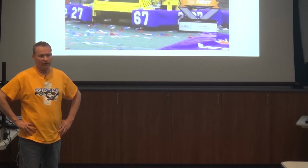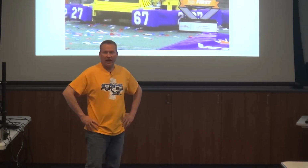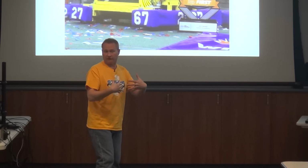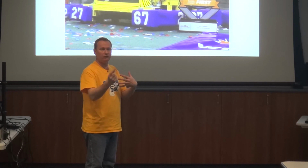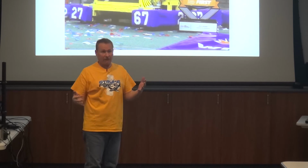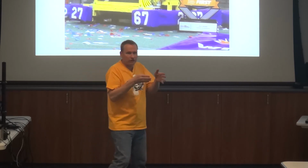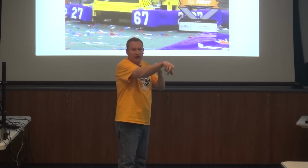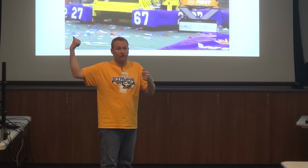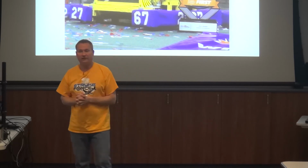Yep. So the way to think of it, there's actually quite a bit of DIO going into the Talon, and you can tell the Talon, I want to use that as my feedback. But that doesn't mean you can't be feeding other things into it and have the Talon tell the RoboRio what's going on. Now, you can't feed in 2 quadrature encoders because there's only one set of hardware. But if I'm actually using an analog pot for my encoder, I could feed a quadrature encoder into it. The RoboRio could ask all day long what's going on, and the Talon will tell it. You just got to pick which one you're going to use in your feedback inside the Talon.